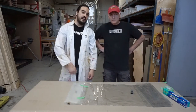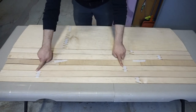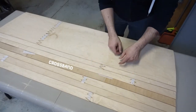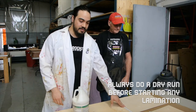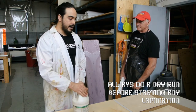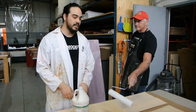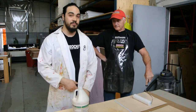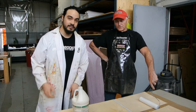Let's laminate that board. First we have to correctly order our pieces. Here we are using seven layers and we have offset all of the splicing from each other — this prevents weak points within the board caused by stacking the splices. We've got our one cross grain piece in the middle of the stack. Our veneer is all pieced together and stacked in the correct order, our mold is prepared, and we are doing a tight bond glue-up for this one. We're using a thin nap paint roller, and because we are doing a tight bond glue-up we've got about nine minutes, so we're using an eight-inch paint roller versus the three-inch ones to speed things up.